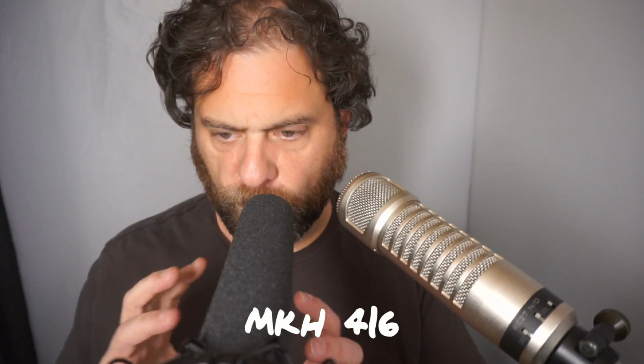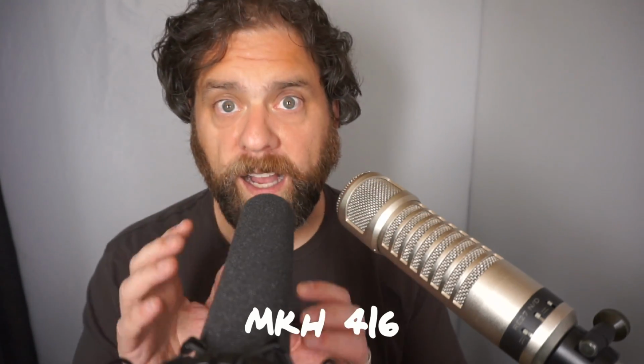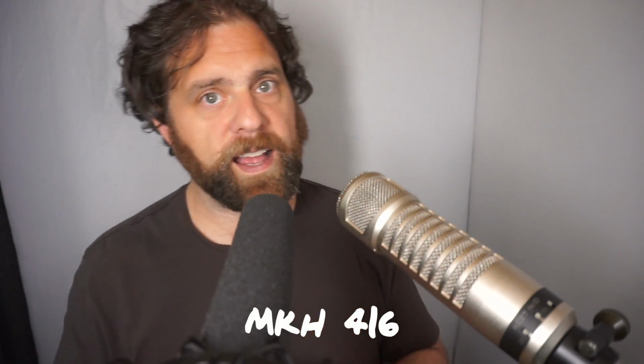It's got a nice bright high end, a pleasant mid-range, and a good robust bass, whereas I feel like this one, because it doesn't have the proximity effect, you won't have as much bass in it, and it's really just a preference thing. The Sennheiser does require a fair bit. You sort of have to lock yourself in position when you're recording with this microphone, because you do get pretty significant EQ changes as you move to and from and side to side. Whereas the 27 I think would be more forgiving of somebody moving around because of the variable D. But that variable D does take some of the bass away.